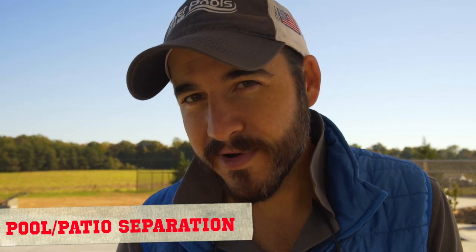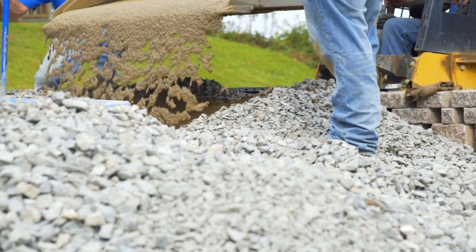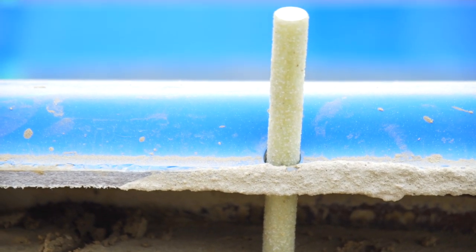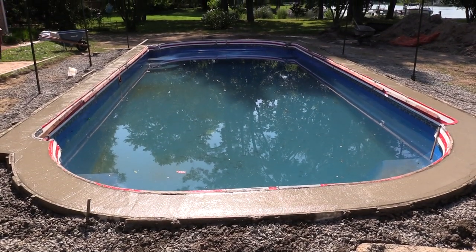Number four: separation of the pool from the patio. Sand settling plays a role in this one too, but for years there was no method of locking the top of your pool into place. Under the right conditions, the top of a pool would be pulled away and separated from the patio or finished decking material. So the Rhino Rock solution is a concrete collar and rhino rods. The rhino rods function like a nail or spike anchoring the top of the pool shell into place. Concrete is poured all the way around the top of your pool, enveloping that top edge, and when cured provides a solid medium for the rhino rod to hold onto. Combined, these two elements lock the top of your pool into place, preventing separation from the patio.